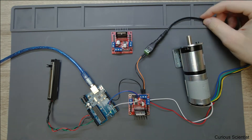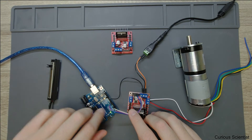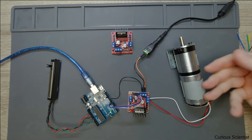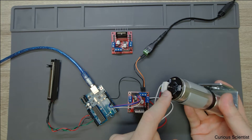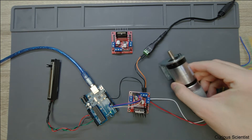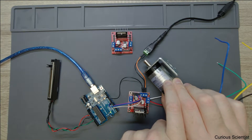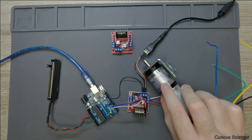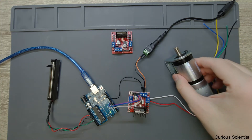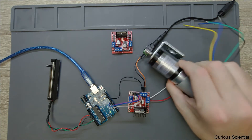I power it with this cable at 12 volts. One very important thing: the ground of the Arduino must be connected to the ground of this circuit, otherwise the motor will not move at all. I have this motor — it's a simple DC motor with a magnetic encoder. The colorful cables are for the encoder signals. There's a planetary gear here, and the gear ratio is 515. At maximum RPM of the DC motor, the RPM on the output shaft is 11.5 RPM.